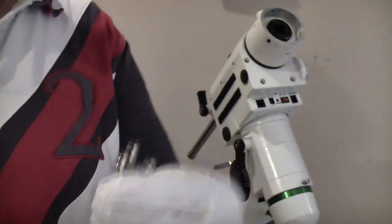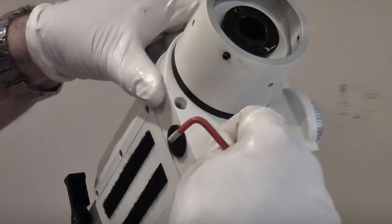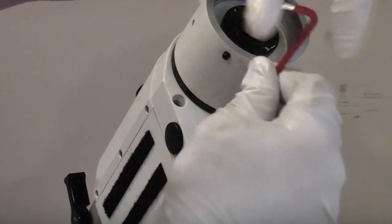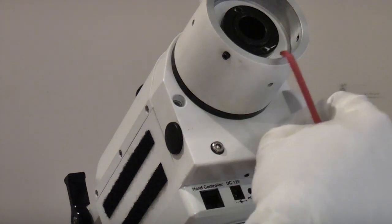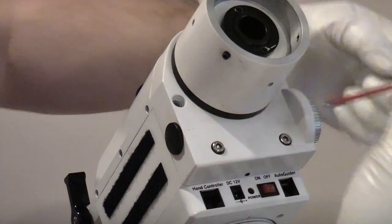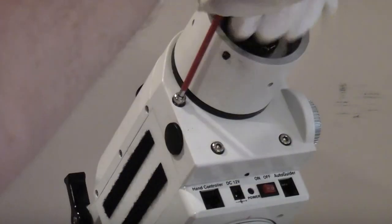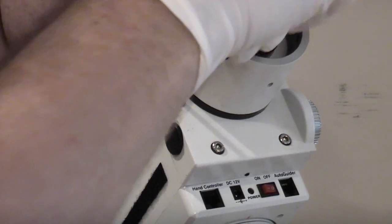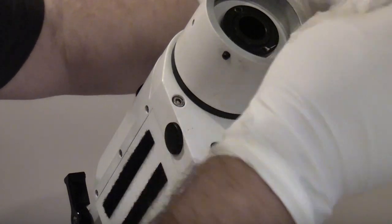And the first thing to do there is to put the three large screws in place to hold the carrier onto the mount. But bearing in mind that we're going to need to tune the backlash from scratch, so we don't want to put these in tightly at all at this stage. So we'll just get the three screws in, and just turn them until they stop, but don't put any kind of torque on them really. So just turning these down until they stop. Okay.